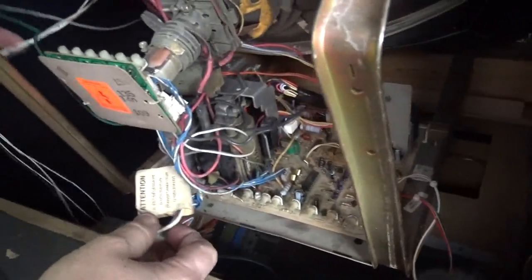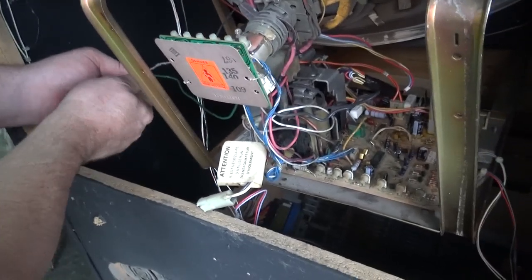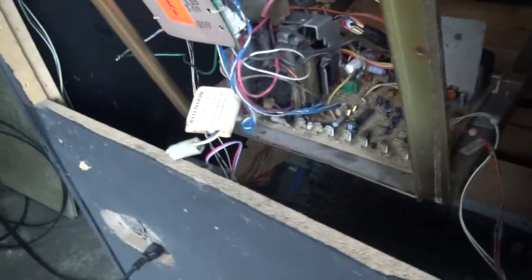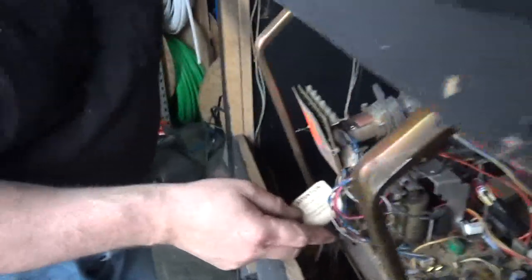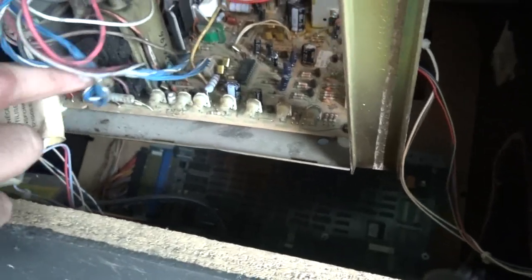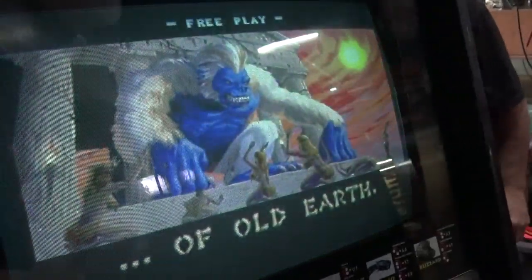Good — now we're done, everything's plugged in. Do a quick eyeball check. We're going to put a wire nut on that return ground — or you can just tape it. For the sake of getting this video finished, we are simply going to turn the game on using a convenient plug. I heard the high voltage start up — that's always a good sign. Now remember the remote is back here, so we'll be making our brightness and vertical hold adjustments there, and master brightness and focus is here.